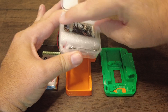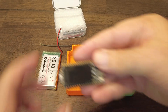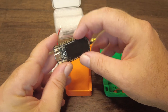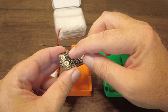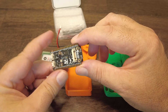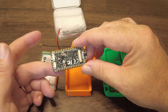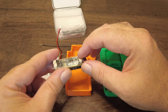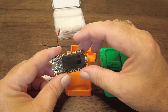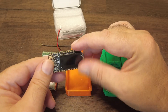It comes in this little case and it looks like this. I think everybody by now has seen some pictures of it. There's some protection around the screen this time, which is cool. They added a solar input and they added a connector where you can plug in the GPS connector straight into there. I don't know about the solar — this is still an ESP32, so it's not really meant for solar at all. I wouldn't run this as a solar node, but as a mobile node or a home node, a MeshTastic or mesh core node, I think this is perfect.